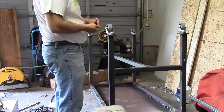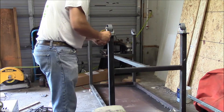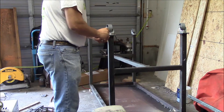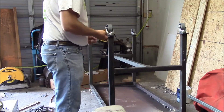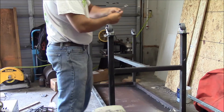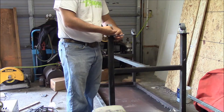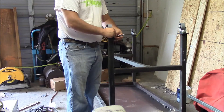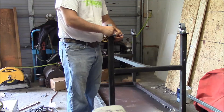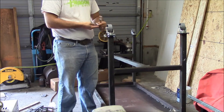After making the trip to the hardware store and picking up some 5/16 bolts — I know this is all lined up for 3/8s, but I think that's a little overkill for the situation. This way I know the bolts are guaranteed to go through the holes. With the plasma-cut edge, the holes were oversized to 400 thousandths, so a 3/8 should have no problem, but I didn't account for misalignment — so this is how I'm taking care of that problem.